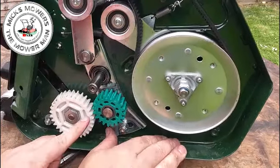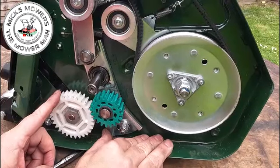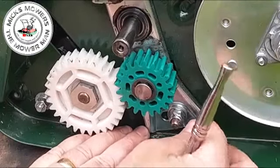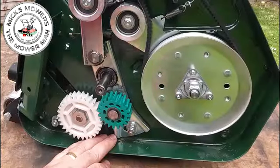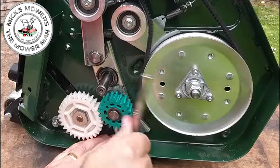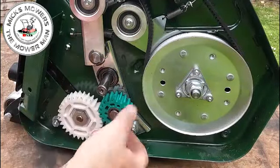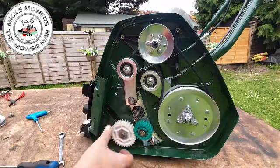You don't want them binding but you just want good contact. All you have to do is loosen off this little tiny 13mm bolt here - just slack it off - and you'll see that this plate is fully adjustable. The gear is not in contact, so bring the gearing down. That's too close, just back it off a touch. You want to be around about three quarters contact. Back the bolt off to about there - about three quarters - and once you have it set, nick that bolt up nice and snug, not too tight. You'll see it will spin much better with not much slack.